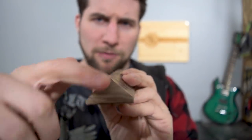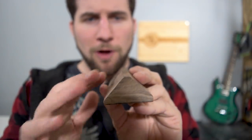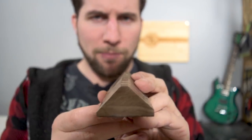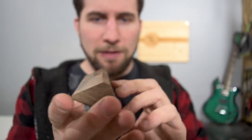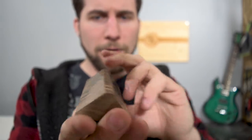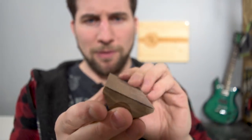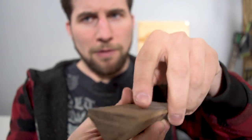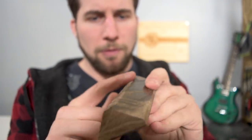Let's show you what we're dealing with here. We have this thin flat spot on top - it's about a quarter inch thick and that will fit between any of the frets on the board, no problem. Nice and flat, gives us a good point of reference for starting. I'm going to go over that with some high-grit sandpaper on a block. We've got our sides at 45 degrees off of that, so that's going to give us our starting point. The flat top doesn't matter - we're not turning this into a fret leveling beam.